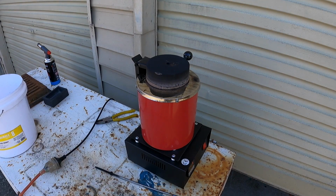And that's why I'll be upgrading shortly to a dual forge, as these furnaces are great for hobbyists, but in this case where you want to melt large amounts of copper quickly and do it efficiently, so there's none of this burning off here. The dual forge has an open flame, whereas this is pretty much just current transformer inducted heat rather than flame heat, so it doesn't burn off properly, and it smokes as you saw, and also doesn't get anywhere near as hot at the top as it does at the bottom of the crucible. So watch this space for the dual forge.